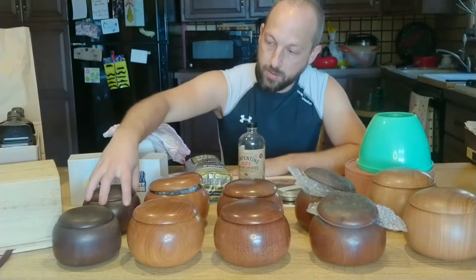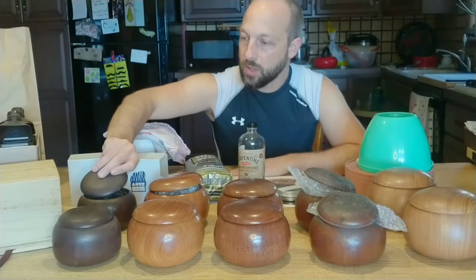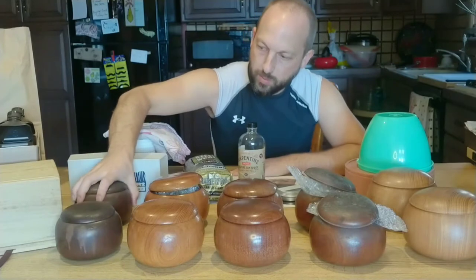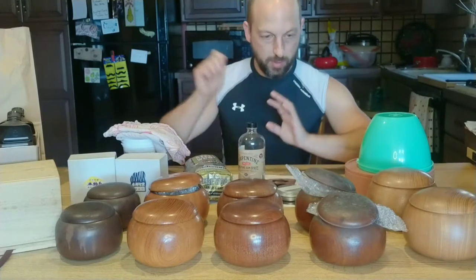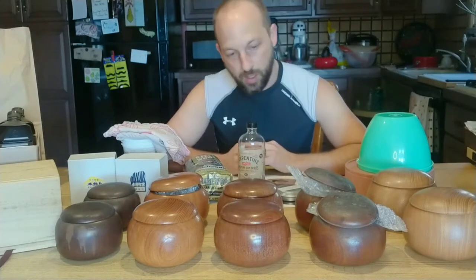On this side, we've got some bowls — one of these has a crack in it. I'm going to have to take some wood glue to that crack and some clamps, and we'll put that bowl back together. We'll do that before we clean it. That way, when we take off the extra glue and give the bowl a good cleaning, that'll take care of it.